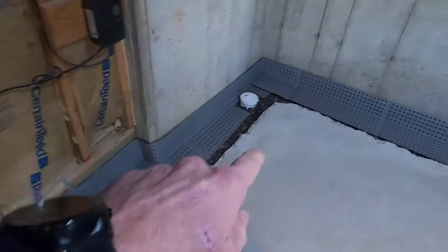That's another clean-out over here so they can jet that out. So that is the sum total of it, Doc — that's how it works. Basically, all you're trying to do is create a way to get the water out of here, give it a low-pressure zone — anything that would come in through the foundation wall, anything that would come over through the threshold, any hydrostatic pressure that might even come from underneath the slab. You could have hydrostatic water pressure in the center of the slab and it will seek the low-pressure zone of that perforated pipe, giving it a place to go so it can get out of here.